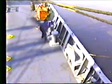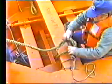Before the boat is lowered to the water, the sea painter must be rigged and the lifeboat drain must be closed. When rigging the sea painter, care must be taken to ensure that it is rigged outboard of any obstructions. The sea painter should be attached to a strong point on the ship and to the forward inboard thwart of the lifeboat. The painter should be attached to the thwart with a toggle, which allows it to be released quickly and safely.